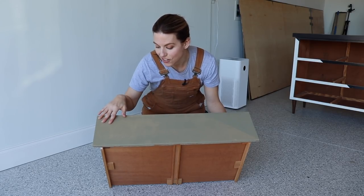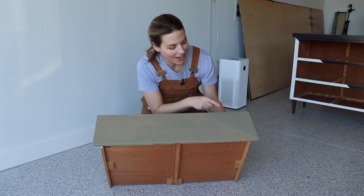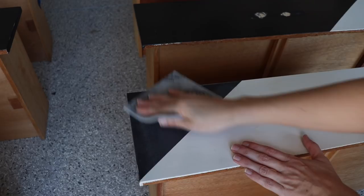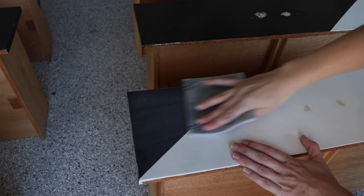I did a test drawer and it's all dry. I was kind of concerned about the black portion because it's raised and has a different texture than the white pieces, and I'm definitely seeing that line — the paint is drying differently on it. So I'm going to sand and smooth back the black part on the drawer fronts so it gives me a nice, even look across the drawer.